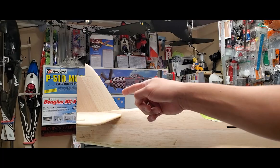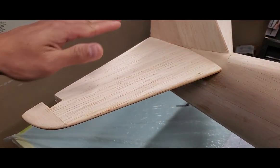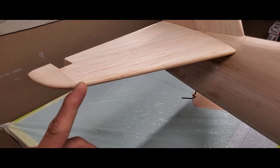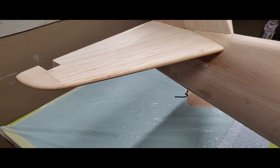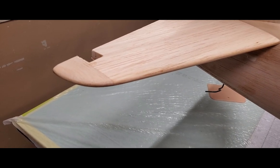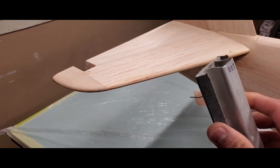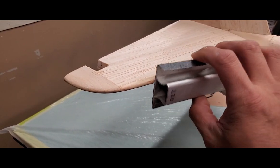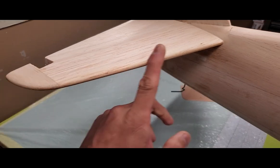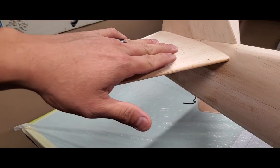Go ahead and put this just like so, and then we'll start right up here. As you can see, we got everything all cleaned up. Just off camera, after we trimmed all this, I came back here with a T-bar sander, and I think this is 100 grit sandpaper, fairly worn out. It wasn't a fresh piece of paper though, so I roughly cleaned up all those edges after the cut line. By doing that, it gave me a nice transition, without sanding any of the balsa.